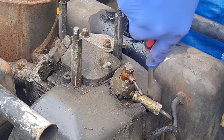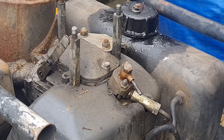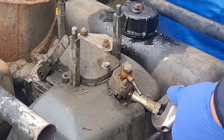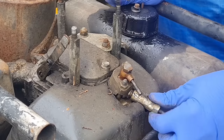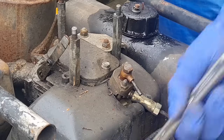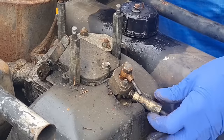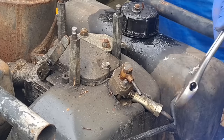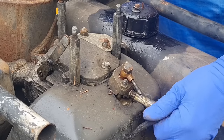We'll just bend this cowling out the way a little. Right, let's crack this off — we'll get our imperial adjustable. She's cracked. We might have to buzz this injector right out, but I just want to see if we're getting any fuel up to here. If we haven't, then we know we've got other problems somewhere. If we have, then we'll probably want this injector out. Adam, why didn't you just get the correct size spanner? I'll learn one day. That is as dry as a bone around there at the minute.